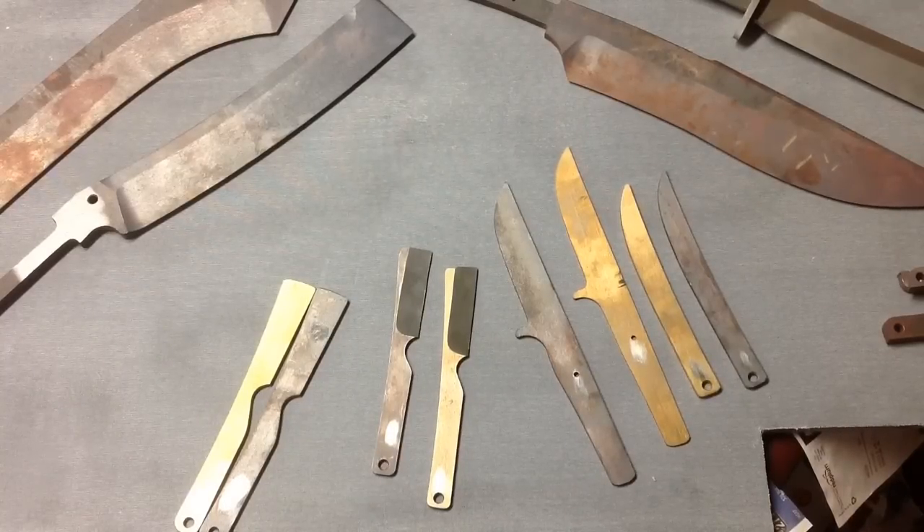One of the things I've been doing is testing different steels with the Bladesports cutting competitions, and that's been, over the last few years, a great testing ground for different materials. CPM-M4 has been a steel that I believe wasn't really popular for knives until we started using it in cutting competitions, and it's done some really good things because of how thin we can run it and still maintain an acceptable level of durability.